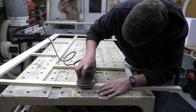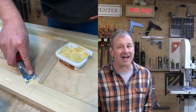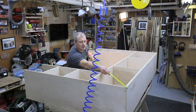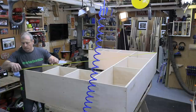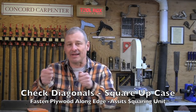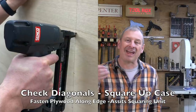I use 80 to 150 grit paper — around 120 grit — for the face frames. I apply filler to all the joints, let it dry, then sand the joints flush to make sure everything looks perfect, then sand the entire face frame to remove mill marks, because those can telegraph through the paint later. Once everything is sanded, put the back panel on. I used quarter-inch birch plywood for the back panel of both the base and top. Check your diagonals to make sure the box is square, apply glue, put the plywood backing on, start on one side, and work your way along the edge checking for square as you fasten. This plywood alignment process also helps square up the bookcase.